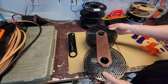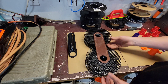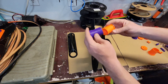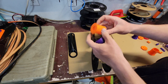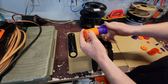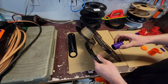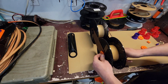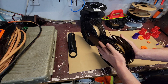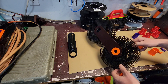That's version one, and it's good enough for wrapping things like Christmas lights or twine that are just going into storage. But for something you're going to handle — like extension cords or rope — the plates will pop off; they won't stay in. That's where these barrel screws, or barrel bolts, come into play. The orange one is the nut and the purple one is the screw, and they just thread into one another. The diameter matches the hole so it indexes itself, but it's hollow so it doesn't use a lot of material. Once you tighten it down with wrenches that fit the internal hex, you can really get a good clamp and it becomes a lot more stout.